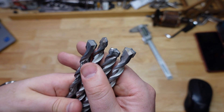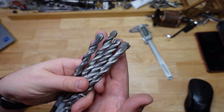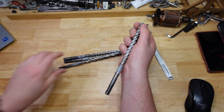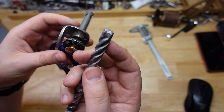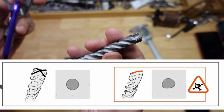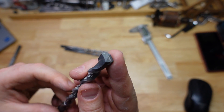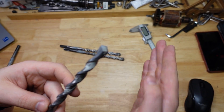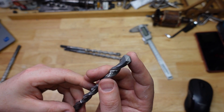Which one is the best style of drill bit for you? I don't really like saying best and worst, because at the end of the day it depends on your requirements. For example, if I'm using these bolts in a rock climbing setting, I need to use the four cutter — no two ways about it. Lives depend on this thing going into a nice round hole, so for that kind of stuff I'm reaching for a four cutter every day of the week. But for all the speed tests I do for YouTube videos, I usually use the standard ones, because they're the cheapest. I've got to grab a new drill bit for every single one of these tests, and that adds up. So I want the cheapest one that's still going to be decent — and these are decent.